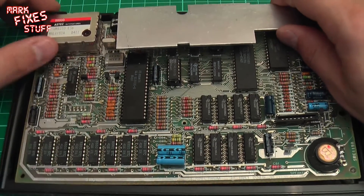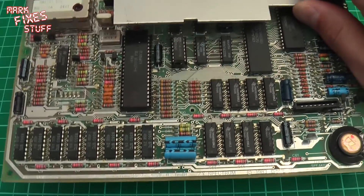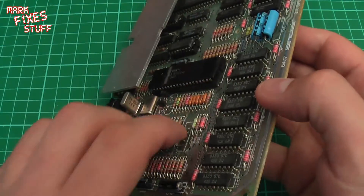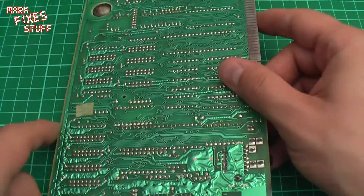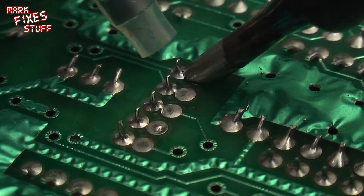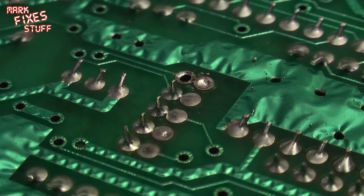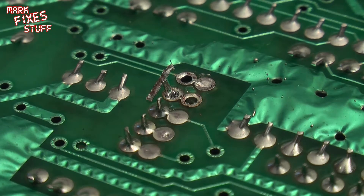Remove the board out of the case — you will probably find that yours has a screw in the middle; this one's been taken out already. Just go around the bottom, find the KB1 connector which is here — the reverse side is here — and we're just going to take those pins out. One, two — that one went a bit astray.